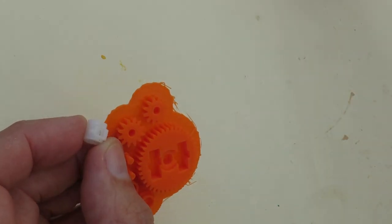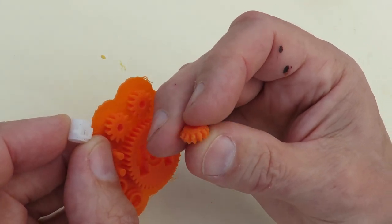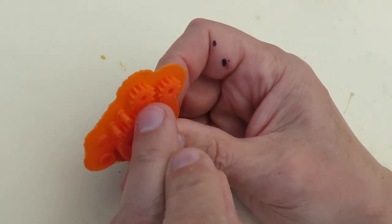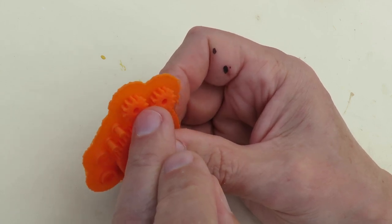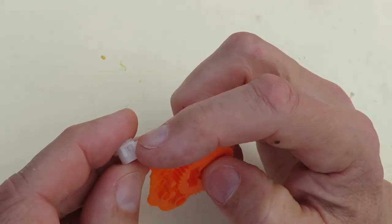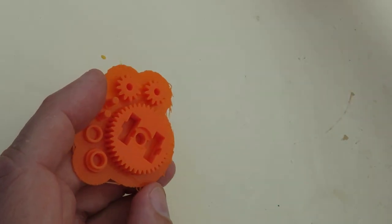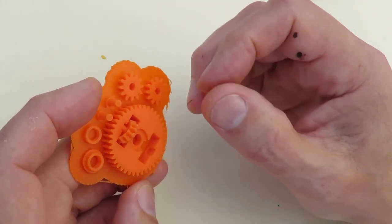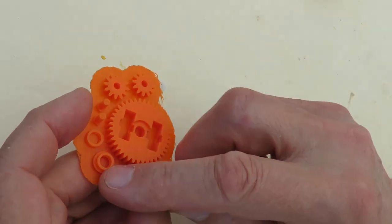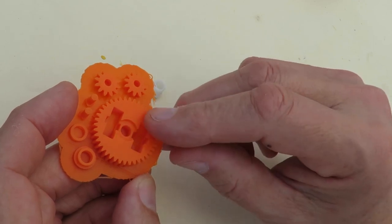which I'm taking to be these planetary gears, as I called them. I tried moulding them all in one piece, and that wasn't working for me, so now I'm moulding a central pin and separate planetary gears. Then that slot in there is that slot there. So these will fit in like that. And then spacers for either side. That spacer goes on there and should actually hold the pins in place to stop them slopping about.